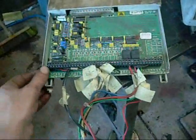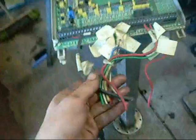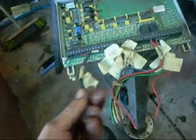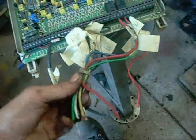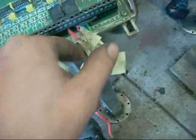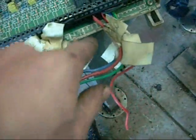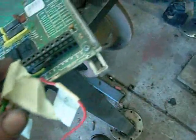It doesn't say what kind of motors it's for. This came off a semi-hermetic refrigeration compressor unit. It's got a speed control pot — a 2000 ohm pot — and all these other ones control relays. It's got PLC-kind of functionality built in, with analog outputs and DC status outputs.